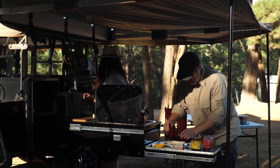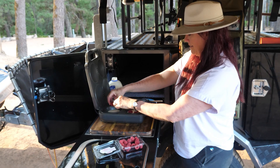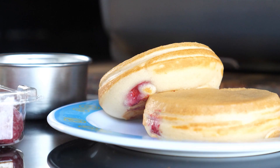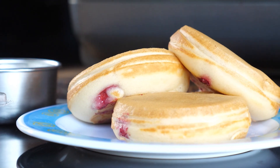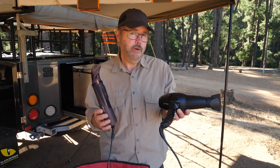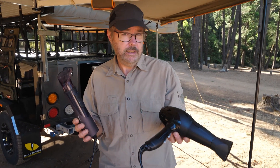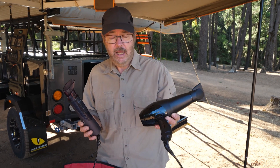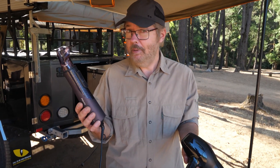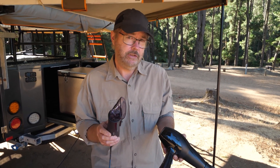We all have our own priorities when it comes to power vampires — whether it's cooking toast, making pancakes, fresh coffee, or maybe even drying your hair. It's all possible thanks to the powerful iTech World 2000 watt inverter. Keep in mind, you can have two very similar items, however they may draw significantly different power rates. This larger hairdryer is 2200 watts, whilst this little guy is only 1000 watts. And that's really important when you're considering the capacity of your inverter.